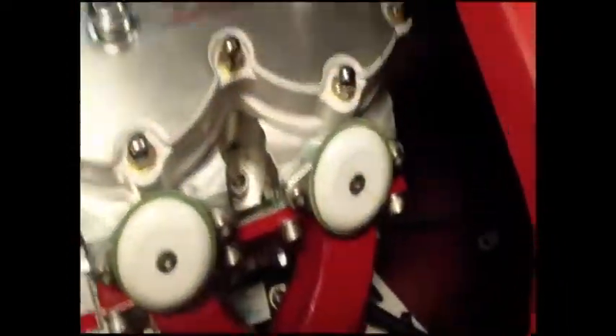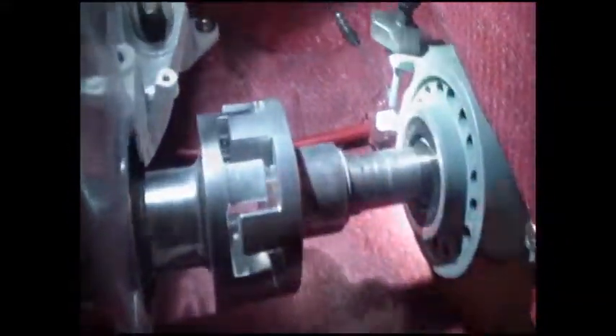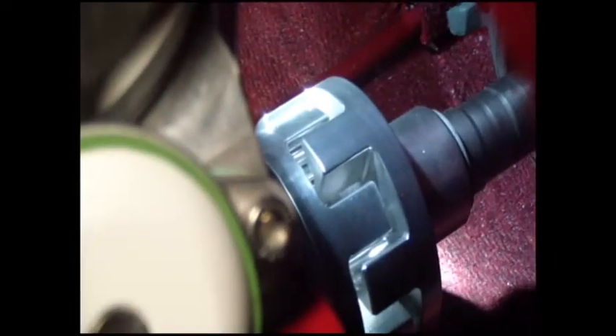Keep in mind that to get it accurate, I dropped all the bolts in just by hand — just a couple threads — so you can see they're standing tall right now. And if you look down below, you can see how misaligned the two couplers are right now. The motor's low compared to the mid-shaft.